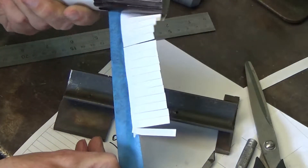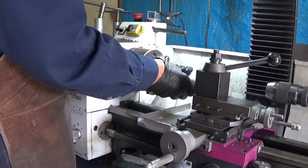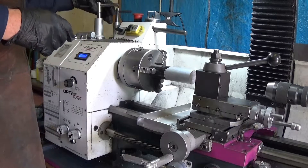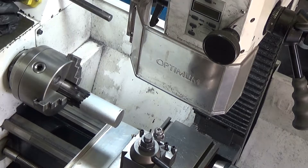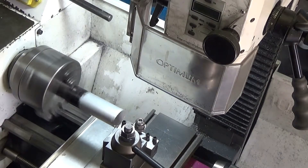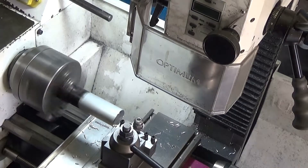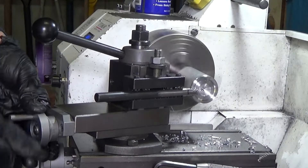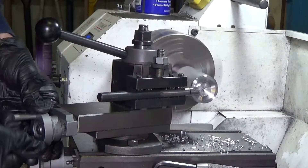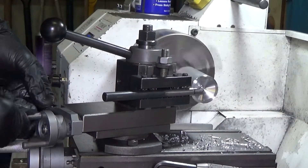And voilà — 18 scratch marks with equal spacing! Now I can go over to the lathe, but before I can do the technical bit I just need to face off the end so that it's nice and straight. I'm also going to put an indentation in the end as well, because this is going to be a plinth. With my top slide on a set angle, I'm just using the top slide to run the boring bar to do that indentation in what's going to be the top of the plinth.